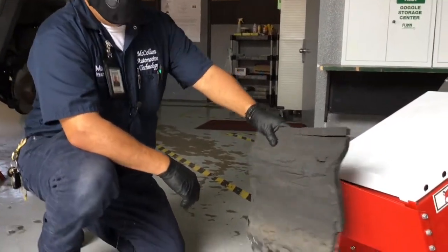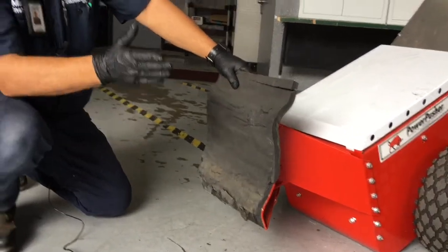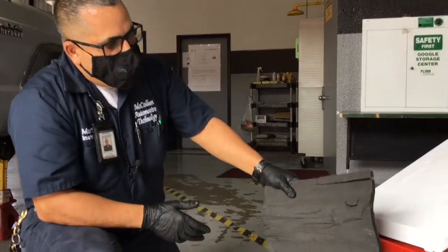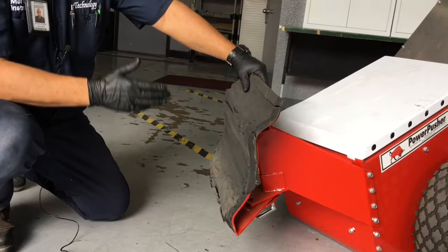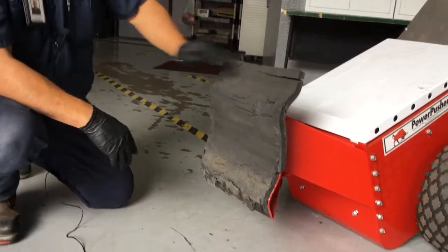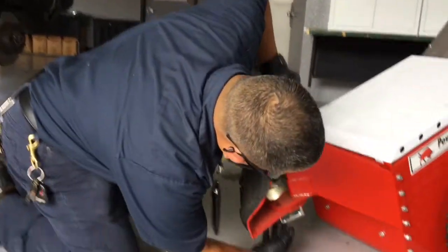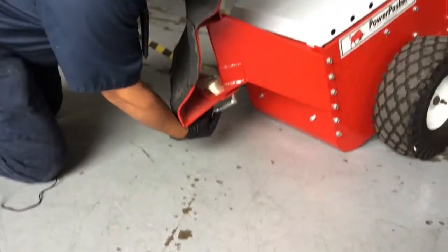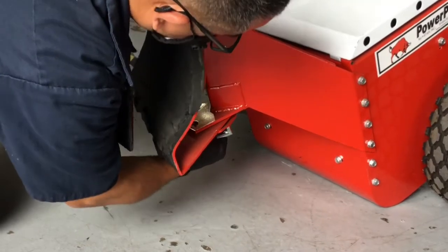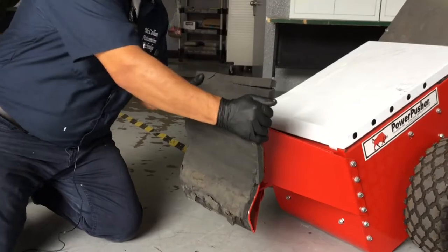And as you can see, this bracket will pivot. That's going to be important when you're pushing a vehicle and it actually has to turn a little bit. This bracket will twist along with it. Now you have the option of having it pivot or stationary. Just like there was a pin on the hub lock, there's also a pin for the bracket, as you can see right here. We'll get you a little closer picture. You pull this out and move it, it'll slide and lock this bracket in place, just like this.